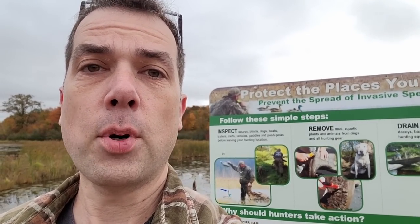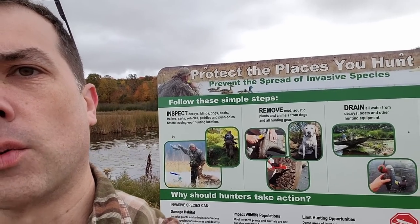The next suggestion was a proper RF ground. While that's a fantastic idea, we've got things going on here where we're not really allowed to put a whole lot of stuff into the environment — pounding a ground rod into the earth here would not be a welcome thing. So I'm not going to do that. Most portable operations, I don't have the ability to ground. This is a portable operation; I can't ground. It might do the trick, but it doesn't fit the mission at hand. Fantastic idea, probably will work, but not what we have in mind.